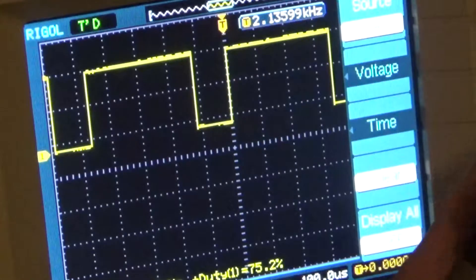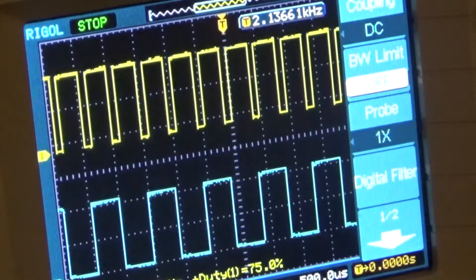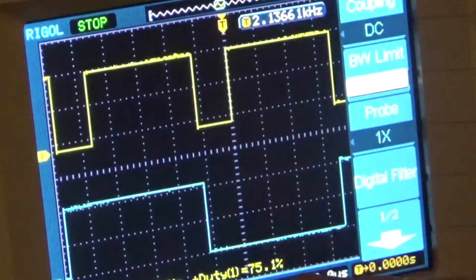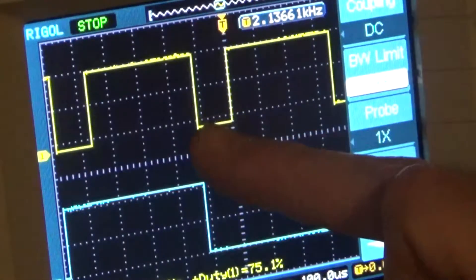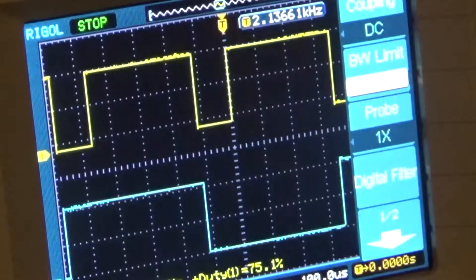If I were to look at the program counter and the 555 signal side by side, the clock is faster than the program counter. The program counter is running at 50 percent duty cycle where the clock is running at 75 percent duty cycle. So the off time and the on time are the same on the program counter. When I built this thing, the schematics didn't call for any resistors or capacitors for debouncing the switch. I have all kinds of problems debouncing the switch when running in manual mode.